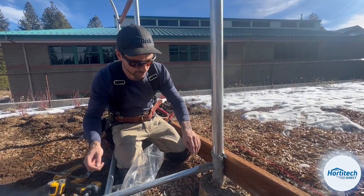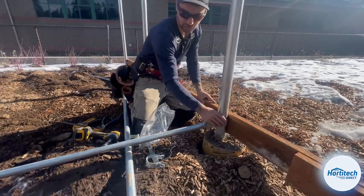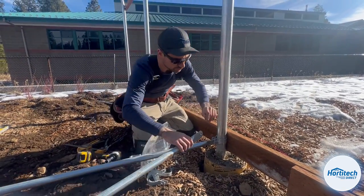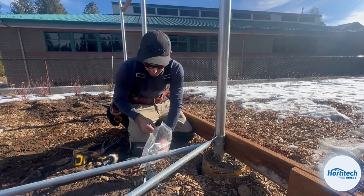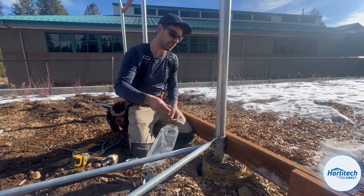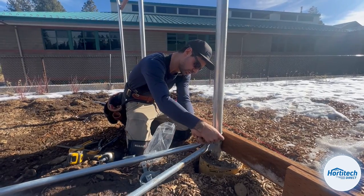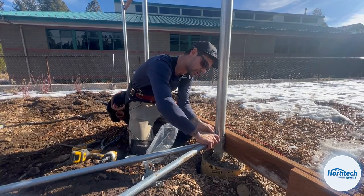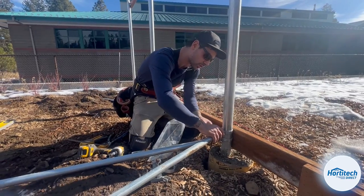So that will go there. I'm gonna repeat the same process with the one right above it. Corner bracing is on all of our models. The size of them will differ. And on this structure, since it's only 20 feet long and each corner brace spans between two bows, and this structure happens to be 5 foot spacing, the corner braces are actually meeting.